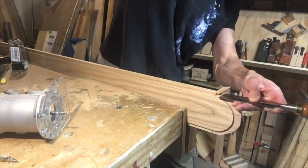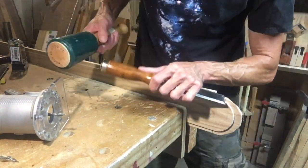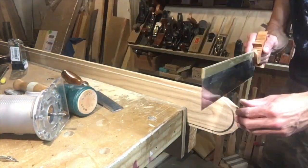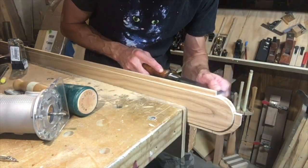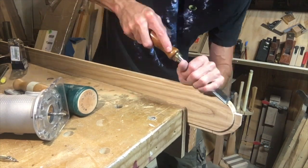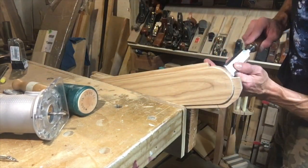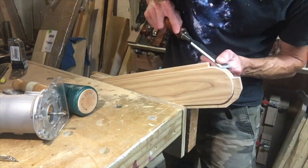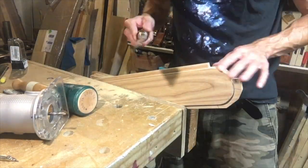Here I'm making a tenon on the inlay. This is me doing handwork with chisels — that's how I love to work. When I was in construction I loved pulling out a chisel, and thankfully in furniture making you get to do that a lot. Look at that shape. Ash is a hardwood, oak is a hardwood, but when you've got sharp steel, wood is no match.